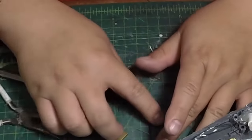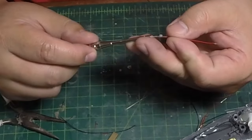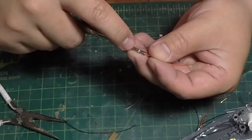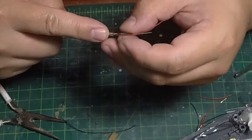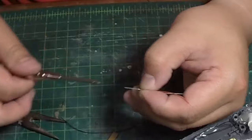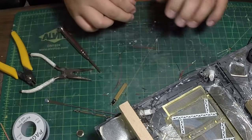Now that I have my wire wrap tool, I'm going to start wrapping this. For the wire wrapping tool there's a top end and a bottom end. Wire goes into the top little hole and comes out through this area right here. I'm going to hold onto it, and for the lead end I'll stick it in the center hole. All you have to do is hold onto both sides and twist. And you have a solid connection, like so. I'll get a black wire for the negative end.